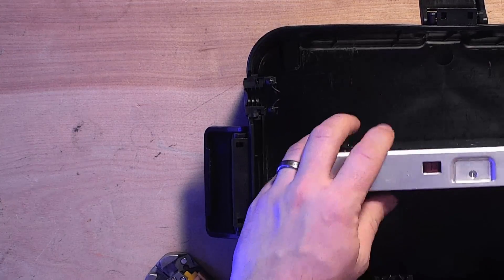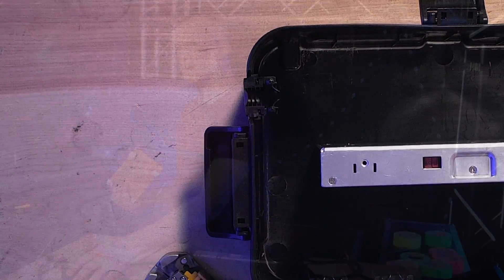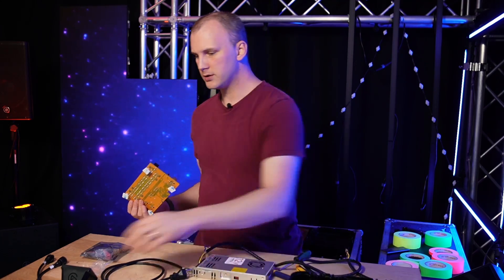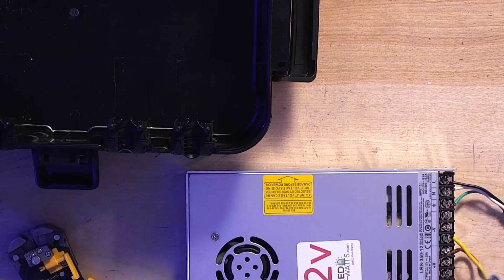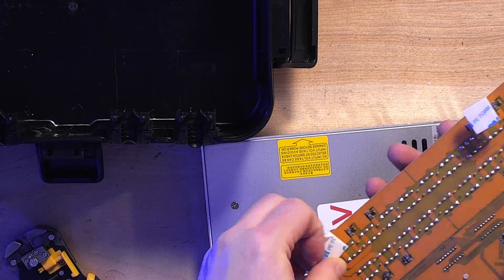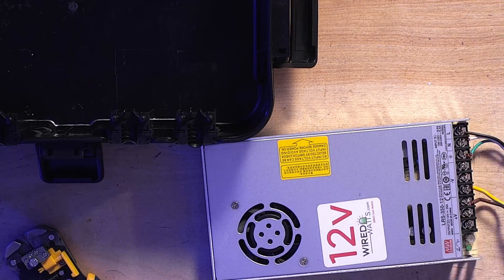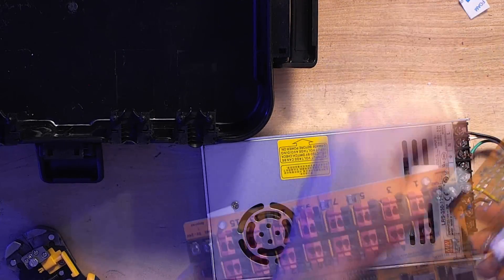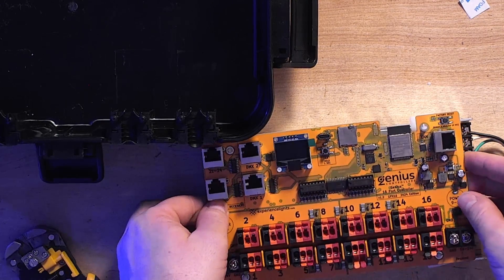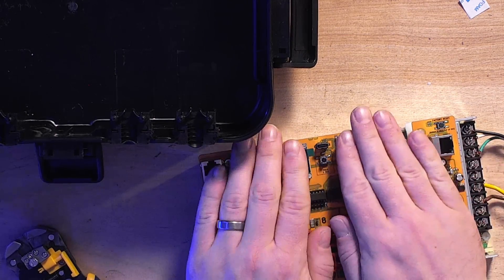While you're here, you always want to make sure on Mean Well power supplies that this is switched to 115 volts. If not, find your nearest flathead screwdriver and change it — otherwise it ain't going to work. Now that we've applied the standoffs, we can go ahead and take the self-adhesives off. I need to do this for my show this year anyway, so might as well do it on camera. Orient it whichever way you want — I would try to line the standoffs so they're not blocking the fan. Gently push down just a little; the adhesives are really good.